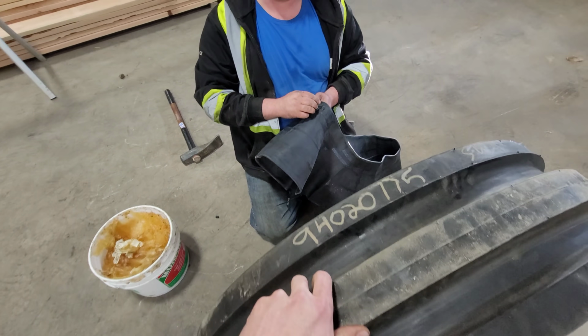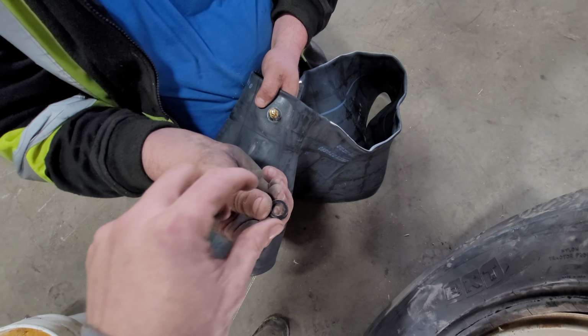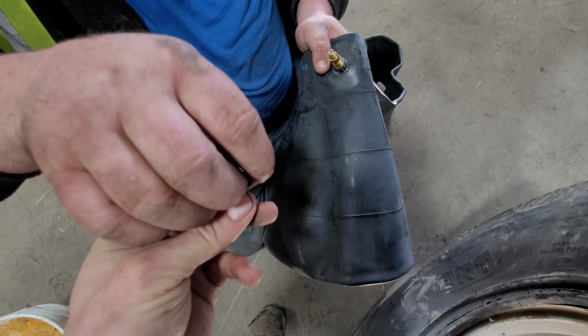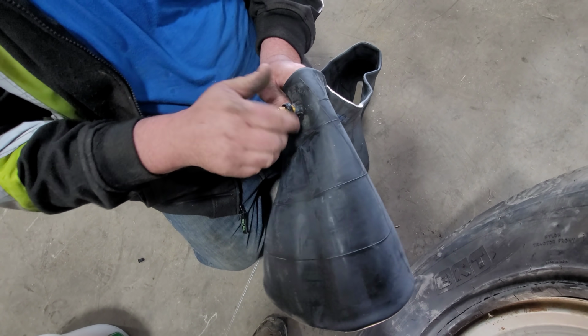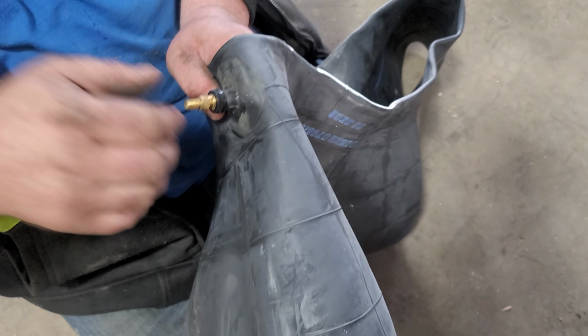What do you mean, a wetting band? What's the definition of a wetting band? This is what we call a wetting band. It's a piece of plastic. So what happens is when I put this tube through the hole, I'll put this on. So if you ever lose air out of the tire, your tube won't be sucked in. Oh, that is stinking handy.